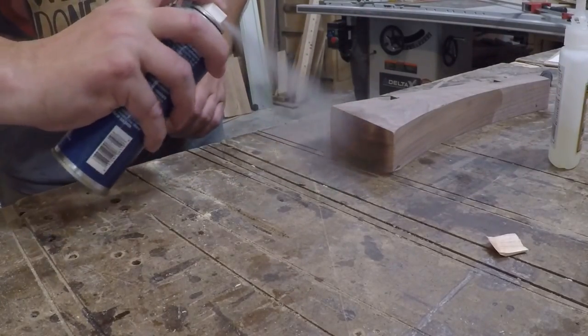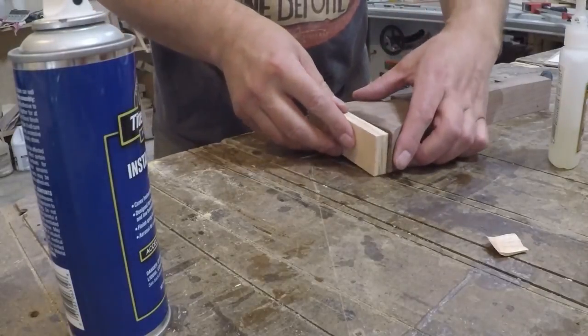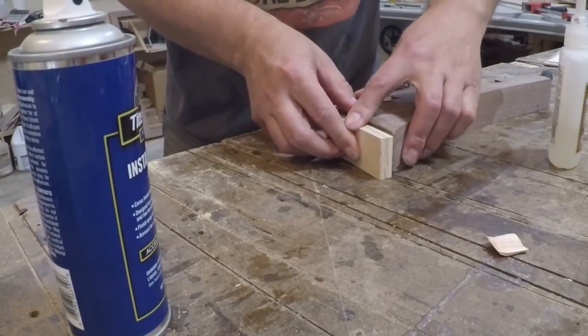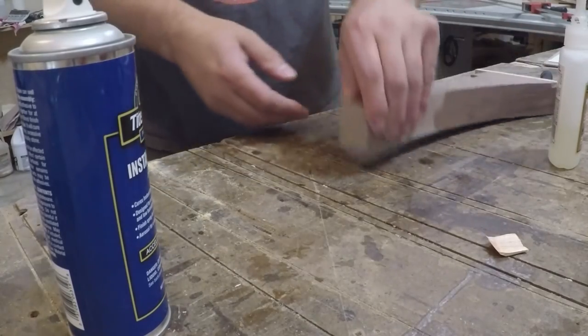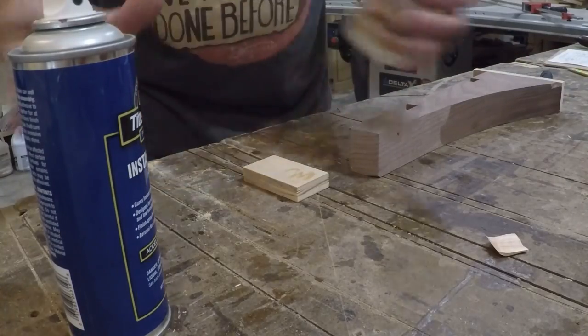I wanted a nice smooth roundover on the front of the legs, so I used a standard roundover bit in the router table. To do this safely, reducing a chance of catch or kickback, ruining me or the workpiece, I glued on some starter plywood blocks.